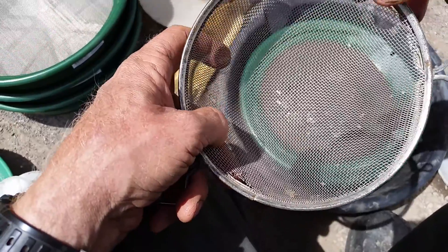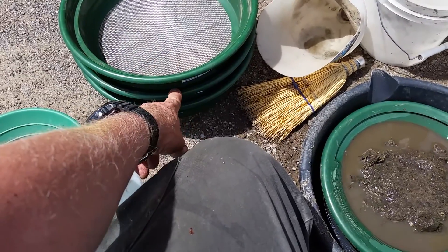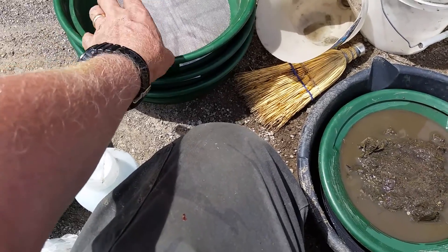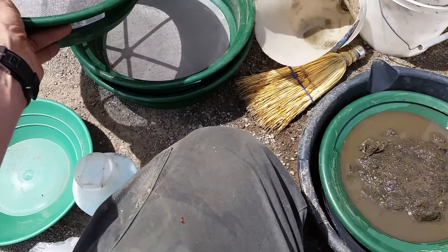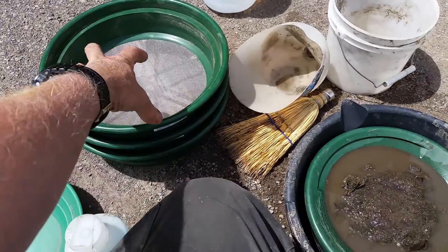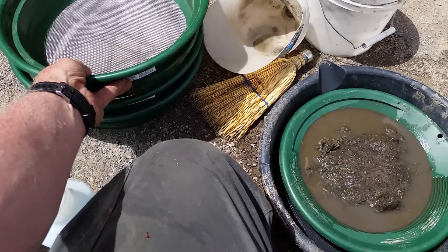Even gold-coated pieces of stainless get caught here. I did purchase some fine classifiers — these are just screens. This one is a 20 mesh, 50 mesh, and a 100 mesh, because I wanted to see what type of material I'm working with. 20 mesh is classified that way because there are 20 holes per linear inch. Most of my material will pass through the 20 mesh. Anything above that I can throw away, and most of it gets caught right at the 50 mesh. The sizing system works like this: if material stays on top of the 20 mesh it's called plus-20; if it goes through, it's minus-20. Same with the 50 mesh — stays above is plus-50, goes through is minus-50.